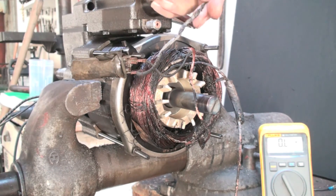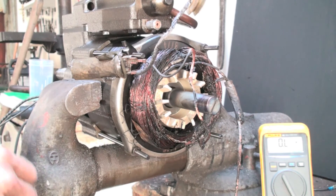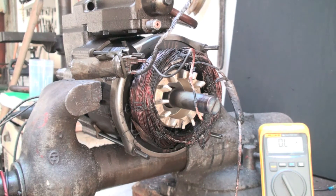There's an open here, but there's no short to ground. So from the outside of this thing, I would not show a shorted compressor, and yet I had a really nasty burnout. So I don't know — should we always just assume there's no real nastiness going on in there by the ohm readings? I'm not sure we should.